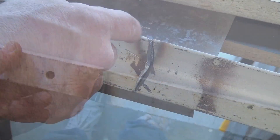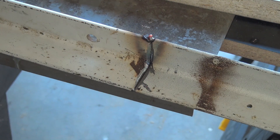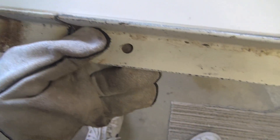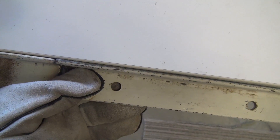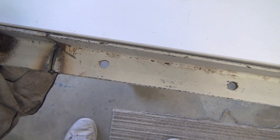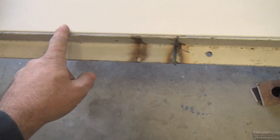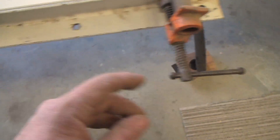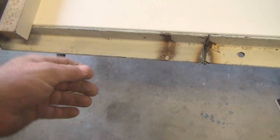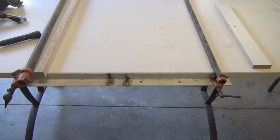I'll do another little tack and check it out. I put that little tack right here - just barely any - and it's warped again. See how it's not straight? It teeter-totters off the center point. I'm going to have to re-cut it and re-bend it. I cut it and now it seems pretty good, just a little bounce to it so I'll bend it. I took some bar clamps and clamped it on this straight piece. I know it's plastic so I don't want to get this hot, but now that it's perfectly straight and level, I'm going to put a little tack right here again, let it cool down, loosen the clamps and see what happens.